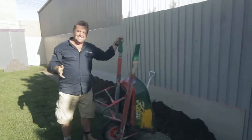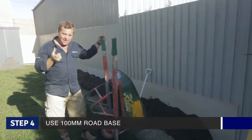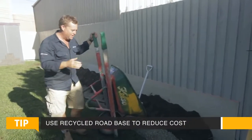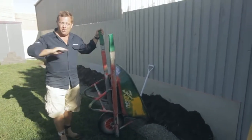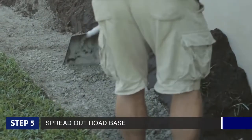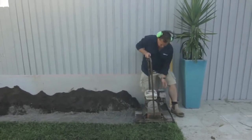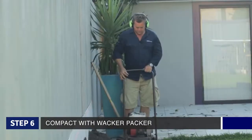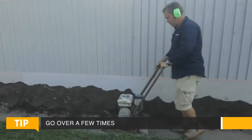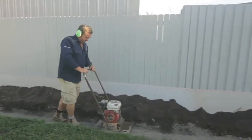The VersaWall is dead easy to put up. You start with a good foundation — I'm using Rebase, the recycled road base. I only need 100 mil deep for what I'm putting up, three courses, and I've gone 400 wide so I can fit my wacker in. I get this as level as I can, but I don't go over the top screening it. I just want to make sure the sand and cement I'm putting down is nice and even — if it's even, it's strong. You can hire a wacker for about 60 bucks for half a day, and it's important that you go over it a couple of times. If it's really dry, dampen it down. And if it's too wet and it's sticking to your plate compactor, you can throw down a little bit of sand over the top — that's just like greasing a tin.